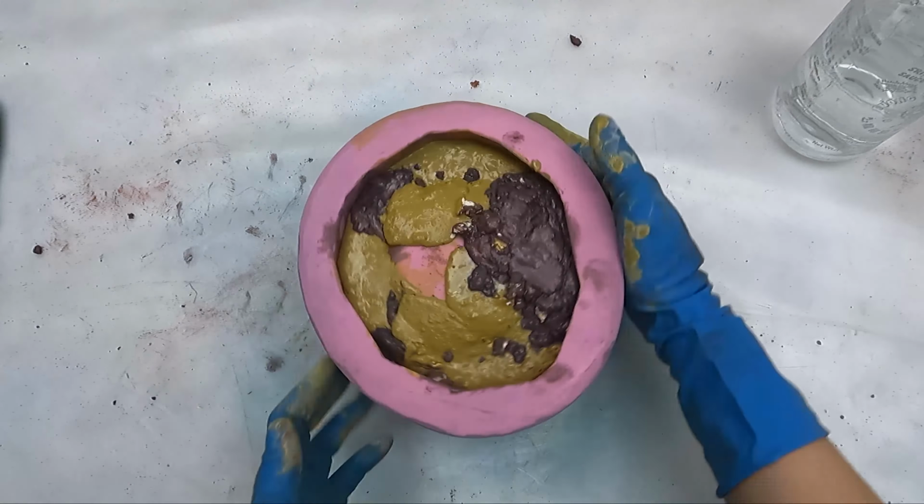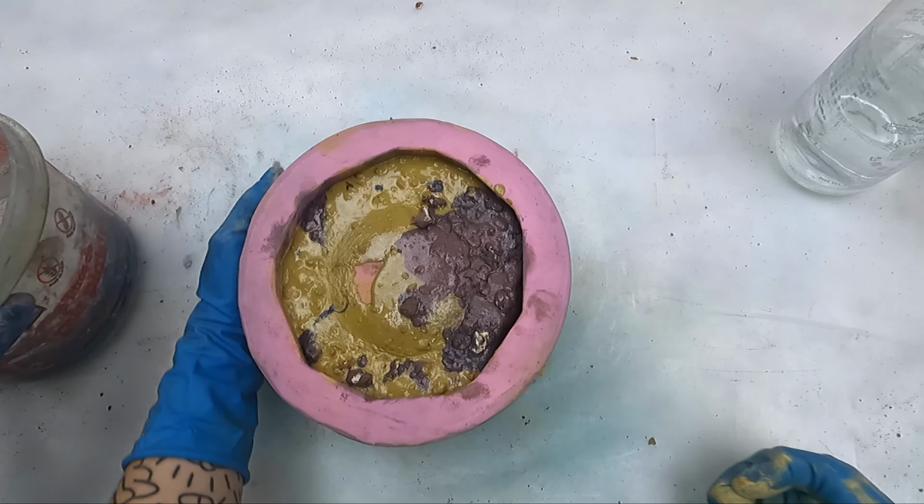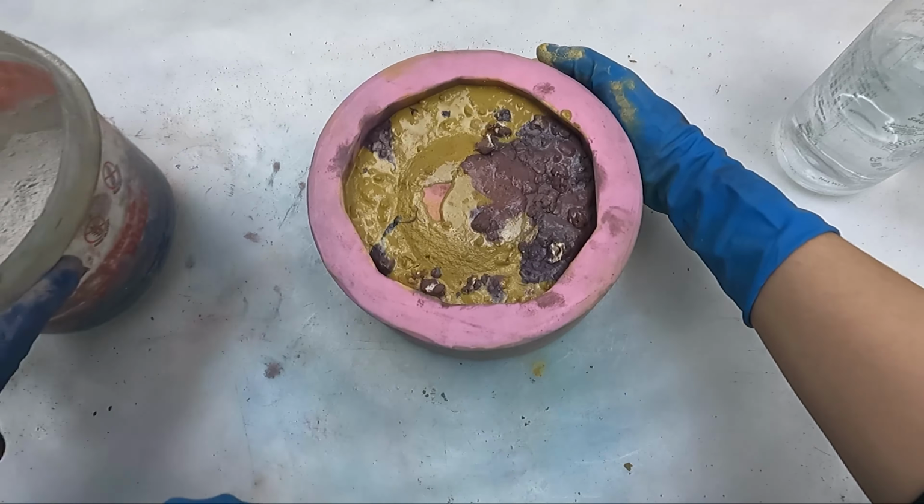You don't want anything that can rot inside your concrete? That's also very true. Your mix needs to be inert, like your aggregate should be inert. Crushed glass works great. Crushed rock works great. Even crushed plastic can work. Things that are not great, popcorn's not great. Wood's not great. What else isn't great?